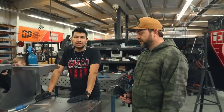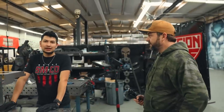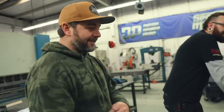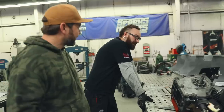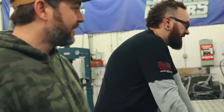That's awesome. One step closer to the finished product. Oh my God, yes, but there's so much more to go. Yeah, there's so much more to go, but you know, we're getting closer. So when you guys powder coat something this big, is there anything extra you have to do other than it takes a lot longer? Not when it's thin metal, but if it was thick stuff, you'd have to preheat it. But I'll just have to hang this and just...